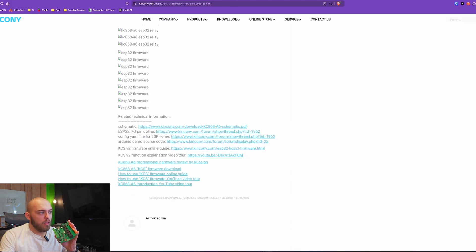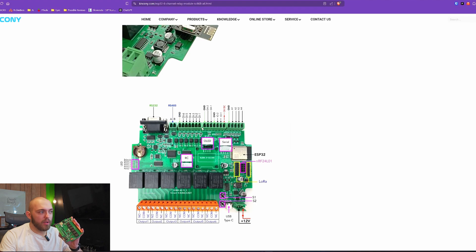Once you go through their website, down at the bottom they have different guides. They even have a full electrical schematic. Up here you can see the different inputs and outputs — it has RS-232, RS-485, digital inputs, GPIO inputs, and some analog inputs that will take zero to five volt input. Not sure what I'll use those for, if they ever work in Home Assistant. But the main ticket is we have the six programmable relays. These relays are rated at 12 amps at 125 volt AC — they're just standard run-of-the-mill relays. They're not going to run anything super big, but they should run a good bit of stuff, especially in a smart home.